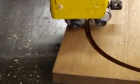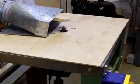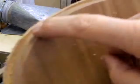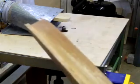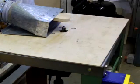In particular here I can think of... just cut this out on the bandsaw. Okay, so get rid of that bit there. Now then, look, you can see we've got the edge here cut originally by the CNC router, and we've got the overhang of the material which I'm going to trim off using the bearing cutter.